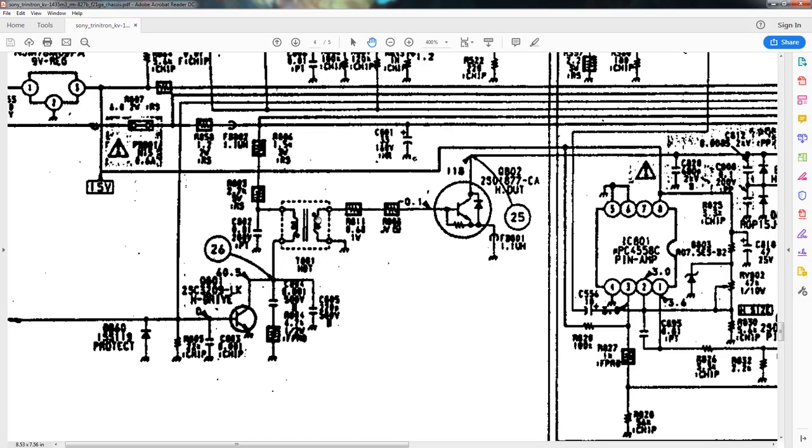Now, this is an interesting detail, just because this isolation transformer can be custom made to be fed any type of voltage, and the voltage on the other end where the beefier power transistor is going to be lower, obviously. But because the voltage is starting out high and is ending up very low, you have a lower voltage with a much higher current as a result. And that higher current, as you know, is very important in driving a power transistor.